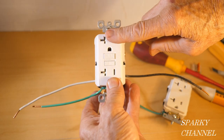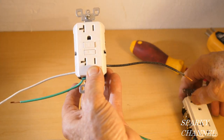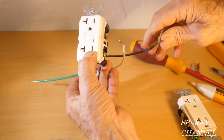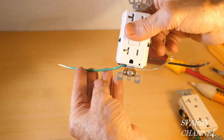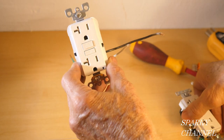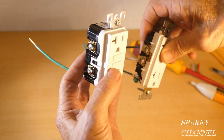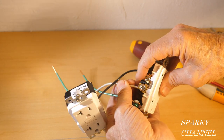I'm going to be putting the GFCI on the left side and the regular receptacle on the right side. Setting it up: we're going to have the neutral over here and the hot over here, and the ground wire is going to go straight to the back. Now we just put this right in here — here's our white wire and it's going to go right here to the silver colored terminal of the receptacle.